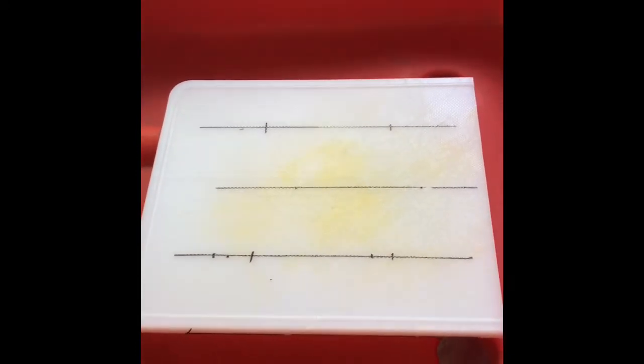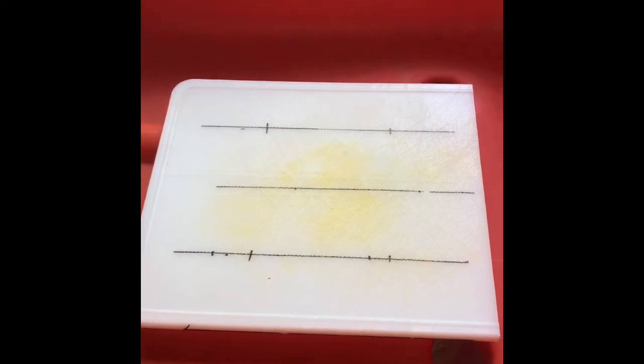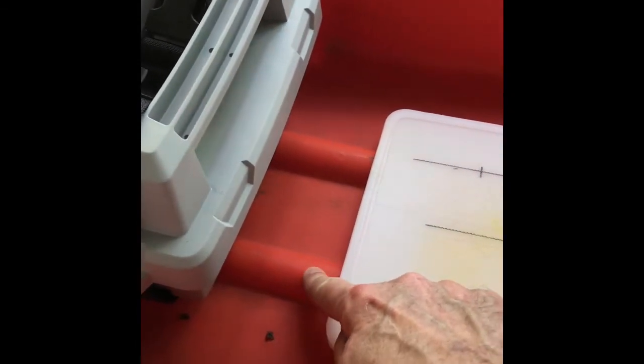And then I'll fasten those with stainless steel screws and nylock nuts. And I'm going to put fender washers on the underside that I'm going to bend to meet the contour of the underside of this rib. As you can see, I've put two flat washers on each screw above the cargo ridge in the hull, so that the white platform is spaced up enough that the straps can slide underneath it to wrap around the platform and anchor the battery in place.